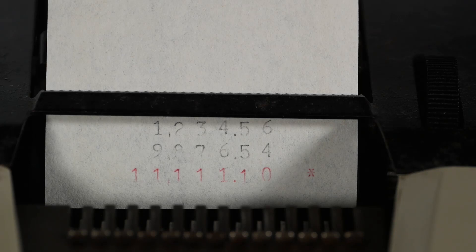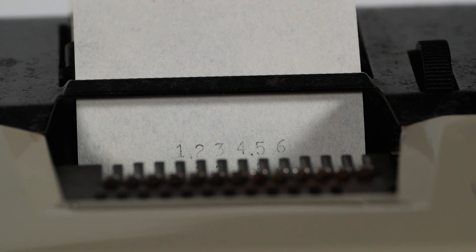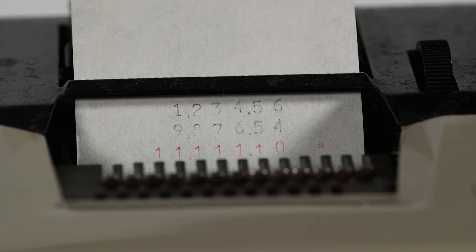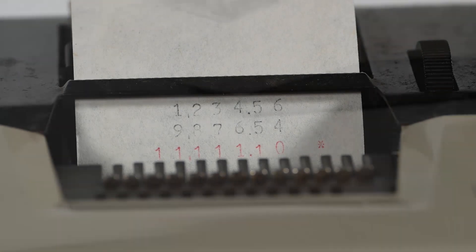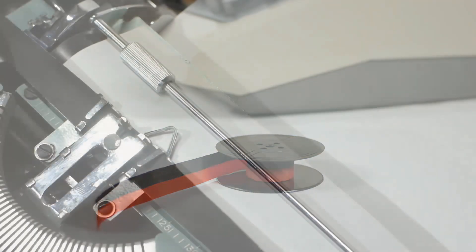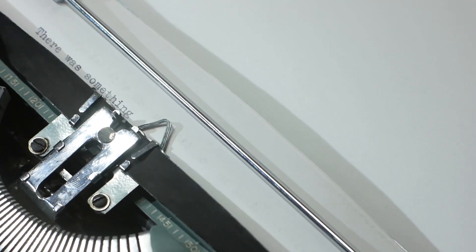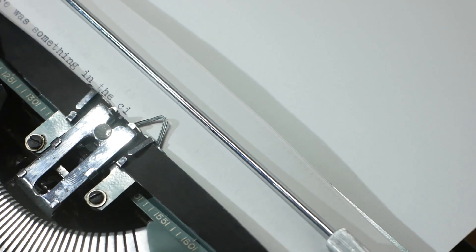The printout is a little bit faint on this machine, and there'll be a number of reasons for this. The platen roller will have become a bit hard over the years, so it's less compliant when the number wheels strike. And the springs that fire the number wheels into the platen roller will also have lost a little bit of tension. But most of all, these machines are supposed to use a heavy inked ribbon, whereas the only thing you seem to be able to get these days are fairly generic nylon typewriter ribbons. Typewriter hammers strike with much greater force than mechanical adding machines, so they generally didn't need such a heavily inked ribbon.